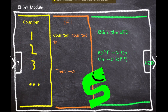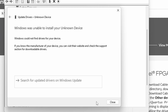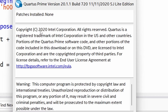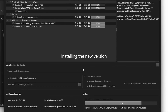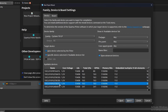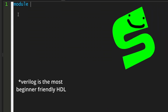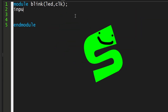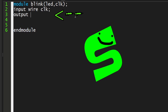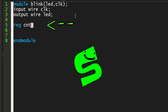And there you have it. Hopefully this cleared things out a little bit. Let's hop on Quartus and try to implement this. A few moments later — right, blank project. Verilog file, starting off with Module Blink, with LED and clock as our I/O. Then we're going to define clock as an input wire — we'll talk about this in a second — and then define LED as an output wire, and then define our counter as a 32-bit register.